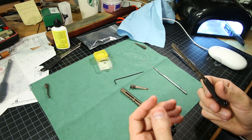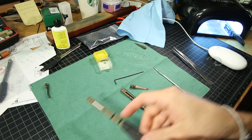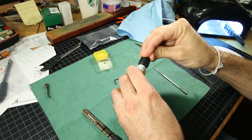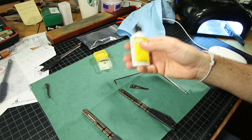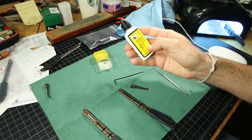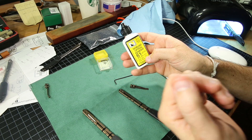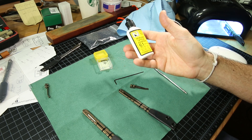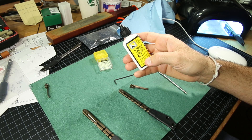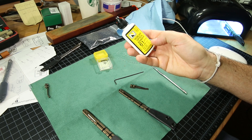I might be overdoing it a little bit, but I'd rather make sure it's hard. When you put it out in the sun, it's going to take hours — not nearly as quick as using the lamp. So the lamp is definitely a better route if you're doing more than one tritium. For personal use, you could just do it by the sun. There are people on places like Candlepower forums that sell small vials of this glue — you don't have to buy an entire bottle. A bottle this size will get you through maybe 50 to 100 tritium installs. These bottles do expire — this new one expires December 2014 — but my last bottle I used two years past its 2012 expiry. All that happened was the viscosity got a little thicker and it didn't cure as fast, taking two to three times as long. But it still worked.